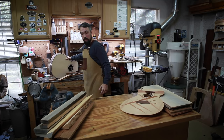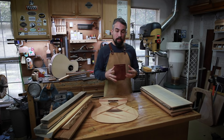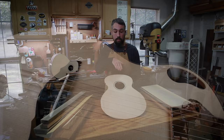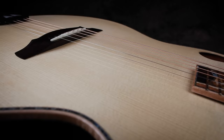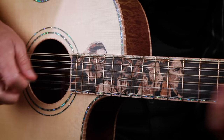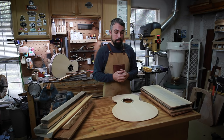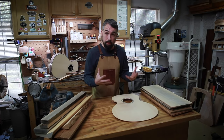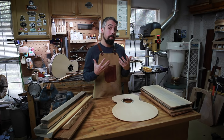What makes a good top wood or soundboard for an acoustic guitar? On steel string flat top acoustic instruments especially, you need to think about how they generate sound. We've got a soundboard glued to the sides, the strings come down and are anchored into the top via a bridge. When you pluck that string, you have a very finite amount of energy being generated. The vast majority of that energy is being wasted into heat. So a soundboard has to be incredibly efficient at capturing that energy and turning it into sound — which means it needs to be very lightweight, very stiff, and very strong.